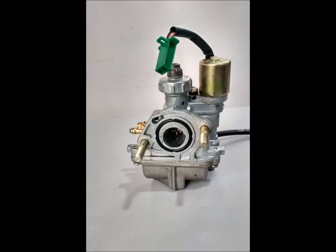Before we get into the working of an auto choke, let us see what an auto choke is. Auto choke is a solenoid valve which, when energized, blocks the airways of a carburetor restricting airflow, therefore letting more fuel — which means a richer mixture — into the cylinder.